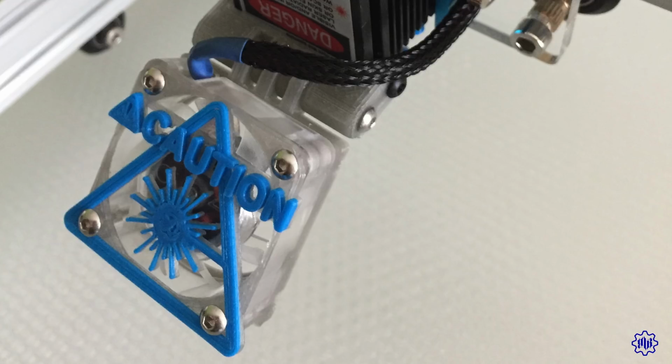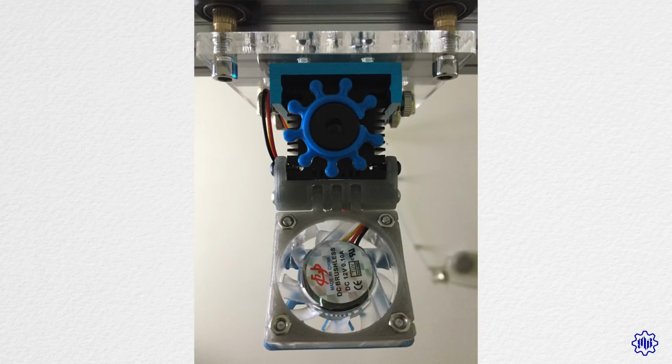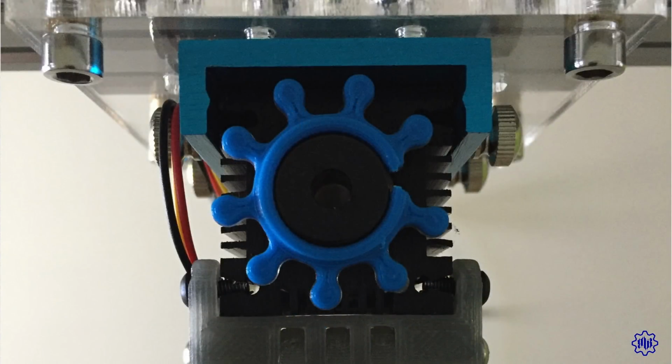This smoke, generated by the fusion of the engraved material, in addition to disturbing the laser beam itself, can deposit on the collimation lens of the laser and, in the long run, damage the laser itself. I also printed, with my 3D printer, a larger ring, which will make the work easier during the focus.